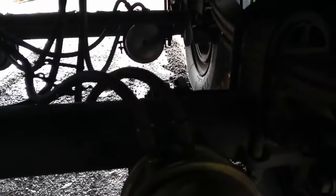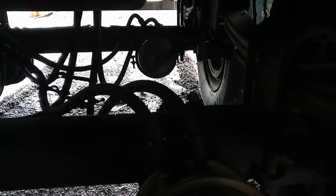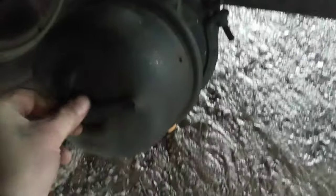Now one problem we're gonna have — see that diaphragm back there? The cap is off, so it might be all dirt up front. Same thing with the other rearmost brake diaphragm — the little rubber cap is off, so that hole is exposed. It might be filled up with dirt and grime, and the inside of the brake might also be filled with dirt and grime.